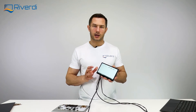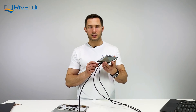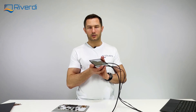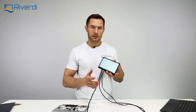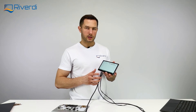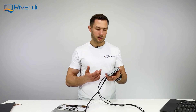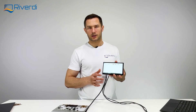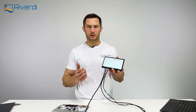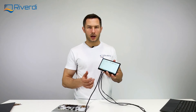Both sizes — 10.1 inch and 7 inch — use the same IPS TFT glass, so you can view the display from all angles without any grayscale inversion effect. Colors are very saturated thanks to IPS, and both are 1000 candela brightness, making them usable in very bright environments — even outdoor, sunlight-readable conditions.